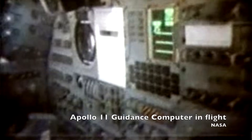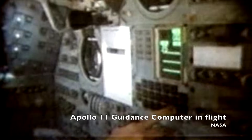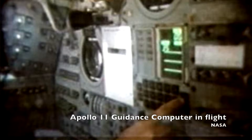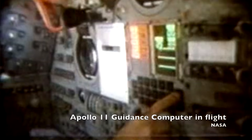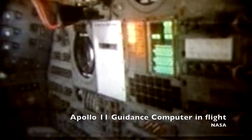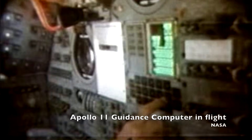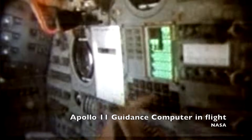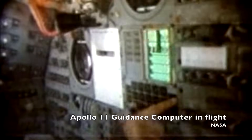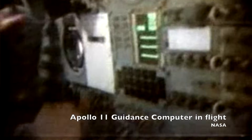But it's also something that you can lose. The phenomenon of Gimbal Lock is one wherein the outer gimbal moves with the spacecraft to a point where it lies parallel to the inner gimbal. At this point, all three gimbal axes would be lined up on a single plane, and none would be able to move around to resume a normal orientation. In short, once the gimbals are lined up, they can't realign themselves to give you an orientation — they become locked. It's the confluence of three angles of the gimbals that creates Gimbal Lock and prevents them from moving out of that situation.